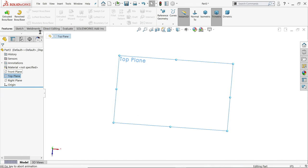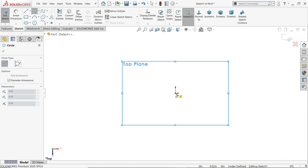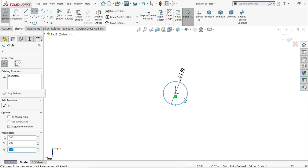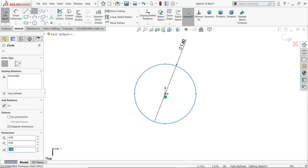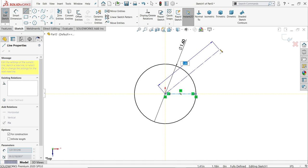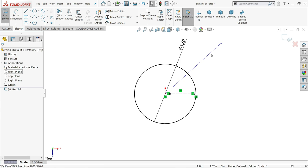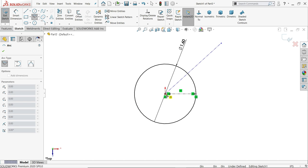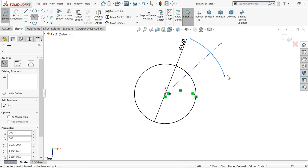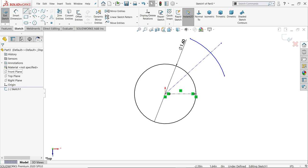So top plane sketch. Now let's make one circle. Now that is 0.8 radius into 2. Okay, this is in inches. Now let me activate some 45 degree. Now let's activate some center point arc. This is start point, and let's say I am going to start from here to here. Escape, activate line tool,